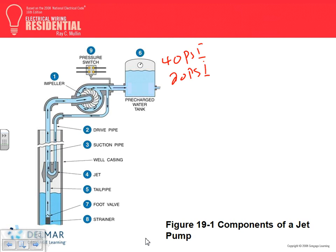So this is part of the control system. Here's your pressure switch. Your circuit is coming. Let's say that your motor is wired right in here, and your circuit is coming here, 240 pump. So let's say this was a 20 amp. 240 pump, 20 amp, 240 pump. See the pressure switch completely disengaged. How does it disengage? See that little water here? When the pressure reaches a higher level, there's a mechanical, physical interlock, and it pushes the contacts to open, physically, mechanically opens up. Smart, don't they?